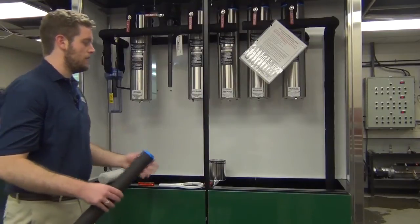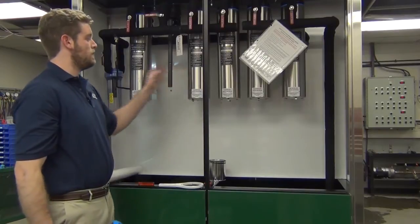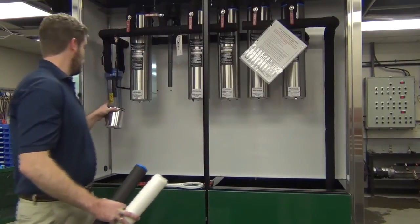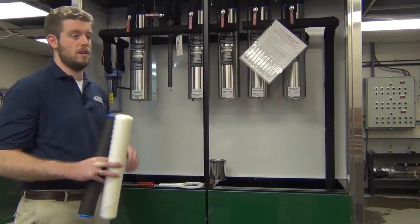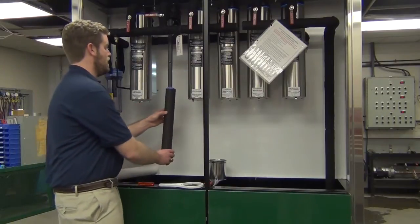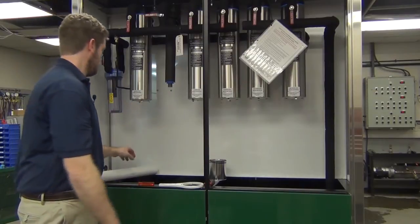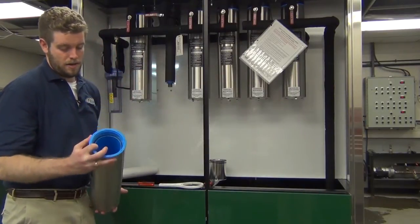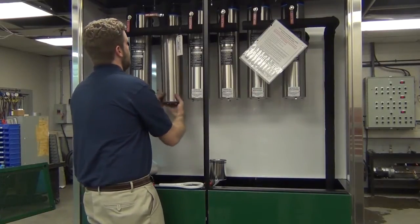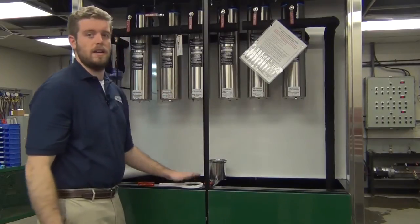Before filling the unit with water, you're going to want to open up the box that contains all the consumables for the chiller. These consumables will include purifier elements, the bottoms of the filter and purifier housings, particulate filter elements, phosphate for the phosphate feeder, and also your UV sterilizer components such as a quartz sleeve, O-rings, gaskets, and your UV bulb. To install one of these purifier elements, simply slide the element over the standpipe, ensuring that all the holes are covered. Then check the inside of the purifier or filter housing to ensure the O-ring is in place. Put the housing over the element and tighten onto the manifold — these only need to be hand tight, even though there is a wrench provided if one gets stuck.